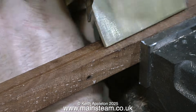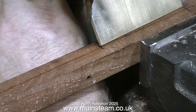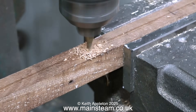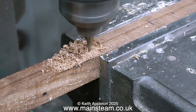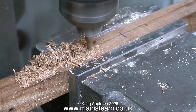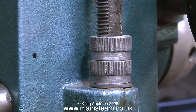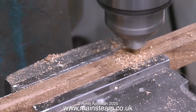Now I need to make a simple mounting to fit this part into the bottom of the boat. I'm going to machine slots in two pieces of mahogany — really good quality wood — currently in the machine vice on the milling machine. I'm using a milling cutter called a slot drill to cut the slots. Because wood is much softer than metal I can cut full depth in one go, although the first cut was a test cut. After confirming it worked, I cleaned off the wood chippings with a paintbrush, then lowered the cutter to the correct depth and set the depth stop so that the second slot would be exactly the same.